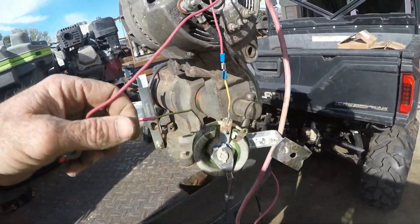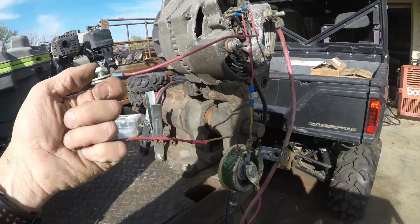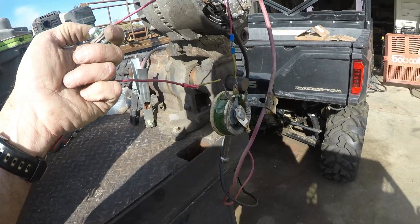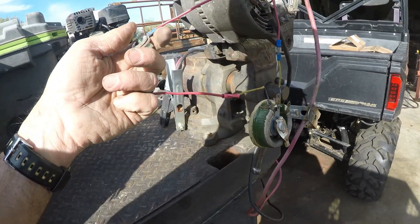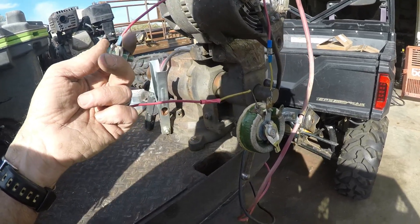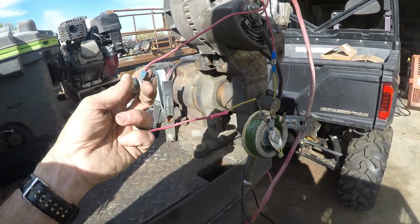The reason for the battery is you have to excite it to make it weld, so the whole time you're welding it is drawing the battery down. But with a standard car battery on this I could weld for about six hours, sometimes a full eight-hour day, depending on how much I was actually using it.